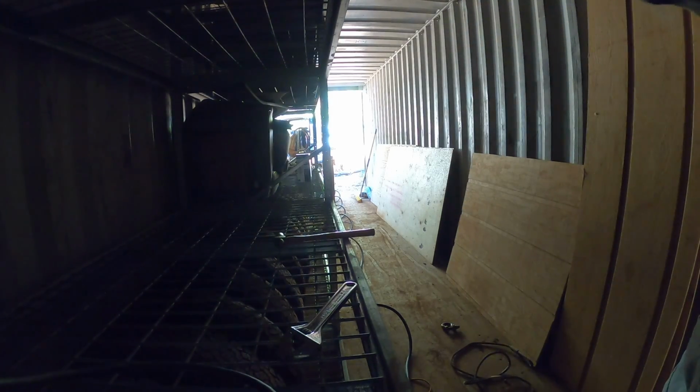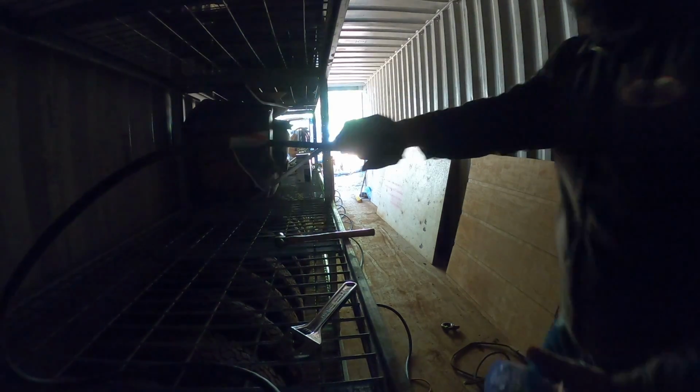I was wondering where the heck it was. I've done this kind of welding before. That's why I have this Miller-Matic here for any on-site welding. So I can just take a generator, and the Miller-Matic 211 is a lot lighter than my Hobart. And I got my small tank, because usually if I got a hard face, which is flux core, you weld with the 75-25 mix and the flux core, you'll have very, very little chance of any porosity whatsoever. And a really, really nice clean weld. But I did stick one side before the breaker kept on popping on the generator. But let's try this again, the right way.